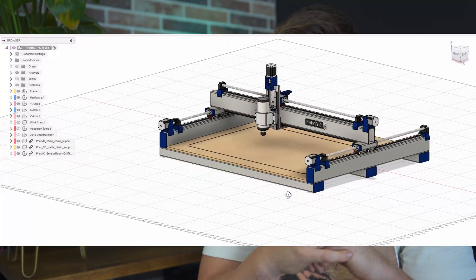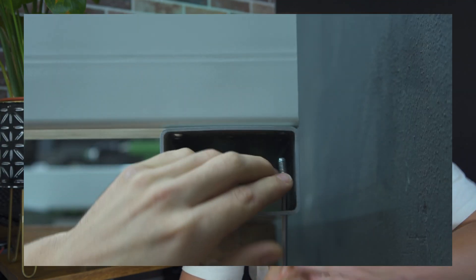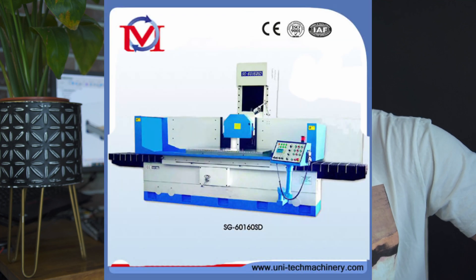Mark Hogan, the creator of this project, has a really awesome parametric Fusion 360 model available for free. The basic assembly is bolted together with screws, and the linear rails get bolted onto the steel beam, so your linear rails are only as flat as your steel is. One could square up all the steel tubing with a big enough mill or surface grinder, but the whole design philosophy was to create an affordable machine that is easy to put together and needs almost no special equipment.